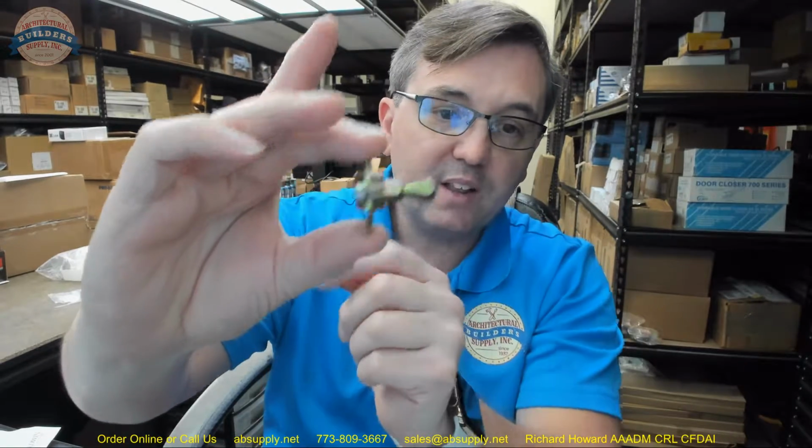What you get with this single dummy is once you drill that hole, pre-drill your holes and get it attached, you're simply going to thread your rose down onto that threaded stem, and then your trim will go over. You'll tighten that with the set screw. Your installation is done. You obviously have to be mindful of your vertical height and then your back set. You want to take an audit of the rest of the doors in the house to make sure that your back sets and your vertical heights are drilled accordingly, because this will not be prepped by your door supplier. This your installer will be doing in the field. So do an audit of the rest of the space and make sure that you are installing the material correctly.